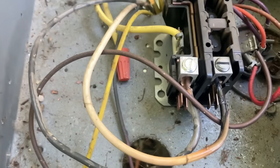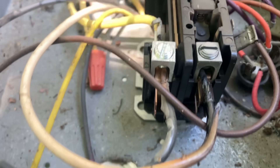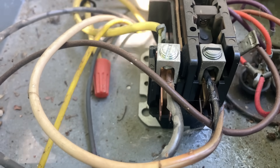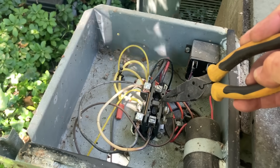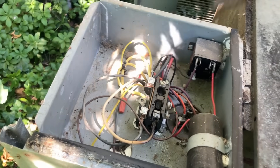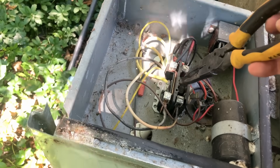Alright, that turns off. Remember how I showed you the one over there melting? The wiring going to what we call the contactor — the high voltage and low voltage switch — is melted. So that's why it's stuck on. This part you can move; it's not gonna bite you. This part right here gets a signal from the thermostat to turn on, and then it takes high voltage here and sends it to the compressor and the fan.